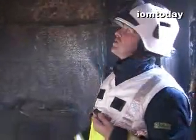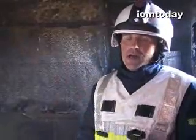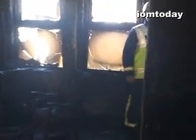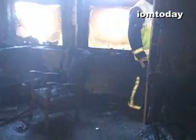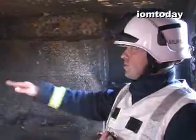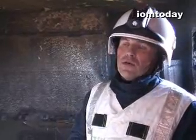I think from the film you can pretty much see what's happened. We were hoping to leave this fire to a point of 15 minutes — hoping that the smoke detector would go off, giving time for people to be roused or discover it and phone the fire service, possibly evacuate. They wouldn't have been able to evacuate at this time. Then the time for the call to be processed, crew to mobilise — turnout time approximately four minutes if on station — and further minutes before committing crews to active firefighting. That's roughly 15 minutes. But just five minutes after igniting, the room flashed over and fire came out of the rear door. We decided for safety reasons not to let it go for 15 minutes, as it would probably have destroyed the house or caused structural collapse, so we activated the sprinkler systems.